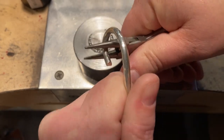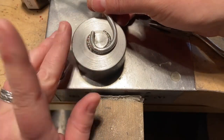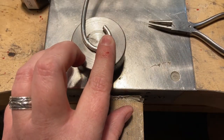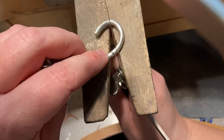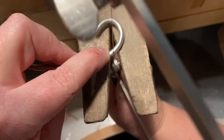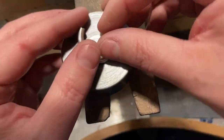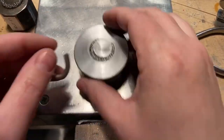When you're choosing material to use with an impression die, you want to make sure that it's at least as thick as the die is deep — you always need excess metal. I'm pretty close here, so I'm going to go ahead and mark where I want to cut it, and then cut it with my jeweler's saw to make this last end a little bit easier to bend into that tighter radius for the crescent. Now I have this smaller piece to work with, and I'm just going to tap it down a little bit more so that it can fit into that crescent shape.